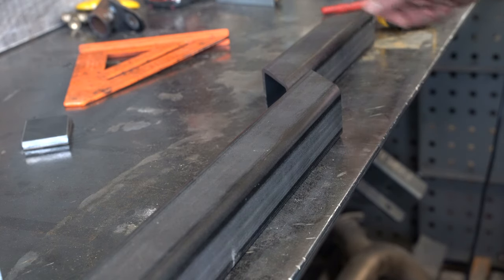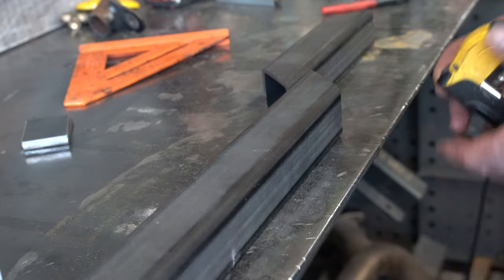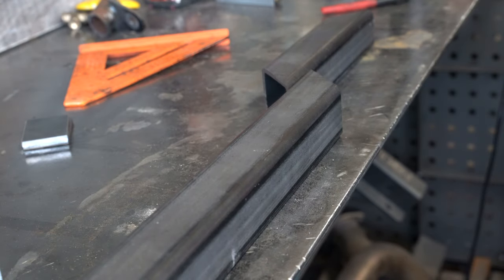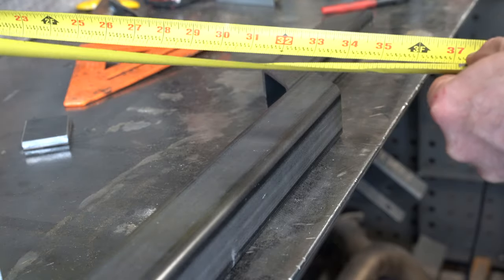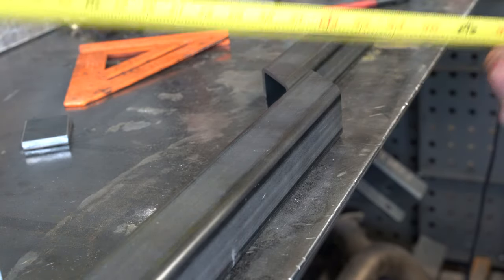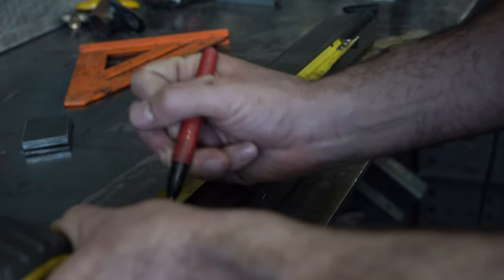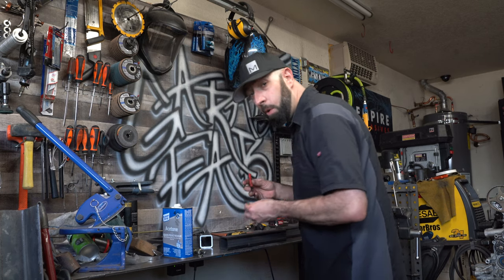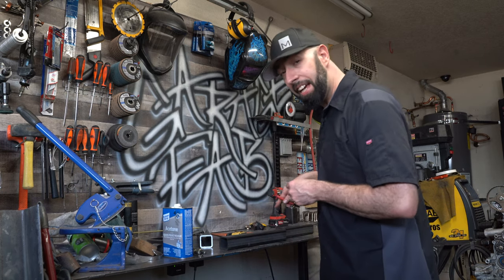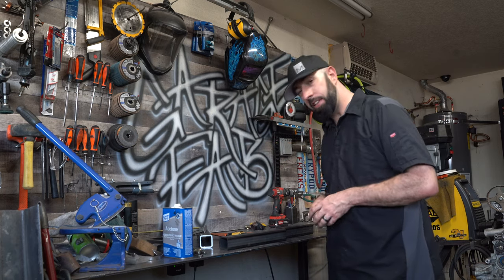With the pipes in place, I can use the center mark on the middle piece to find how long the outer piece needs to be. The total width of the cross member is 38 and a half, so the center mark needs to be at 19 and a quarter. From that center mark, I'll mark 19 and a quarter. One side's figured out — I'm going to do the other side exactly the same way, tack it together and make sure that it's the right width.